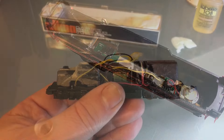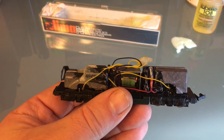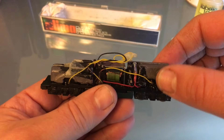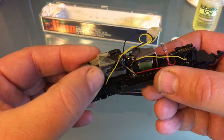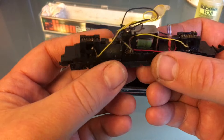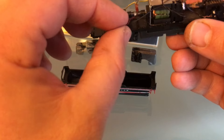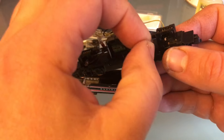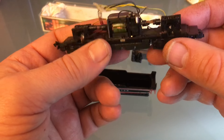Let's see if I can get it up over the motor. When I saw this for sale on eBay, I said to myself, somebody tried to convert this to DCC or something — all these wires, it's a complete mess. So to make sure everything fits, I'm going to just remove the weights. And you can see here, some of these wires are disconnected, so there's no way this would run. I have to redo all the wiring.